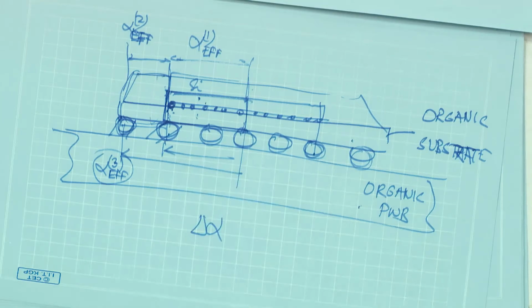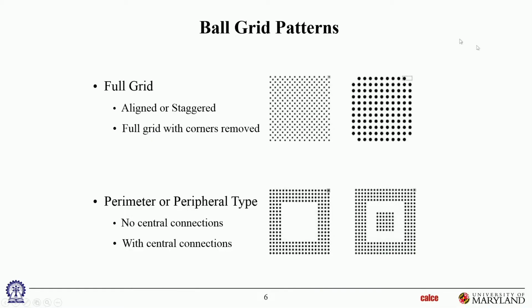If we go back here. So if you have a fairly large die, we see quite often that the one that's at the outer corner of the die shadow or the die footprint may fail before the one at the far outer corner of the package. Okay. So bottom line, you have to be a little bit careful with these designs. A little bit of analysis is needed in order to see which are the highest risk joints over there.